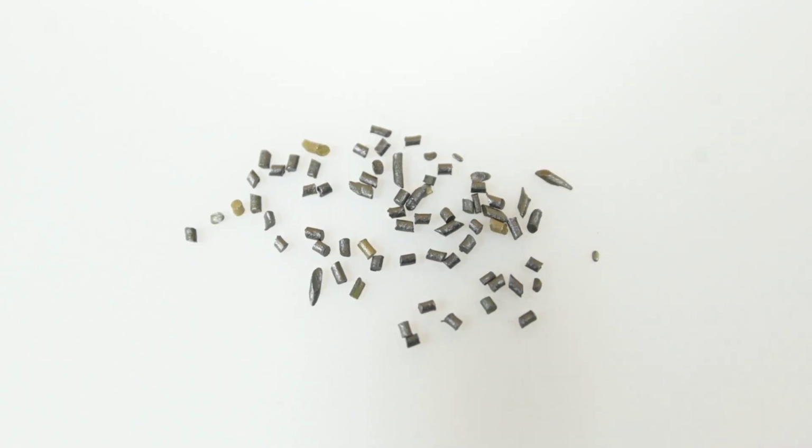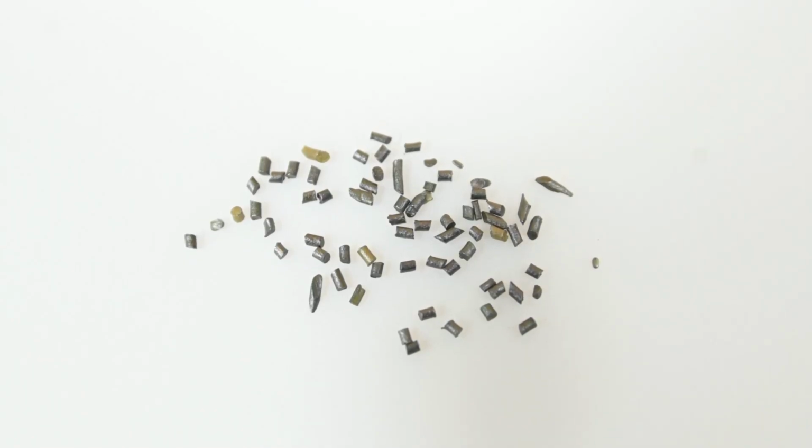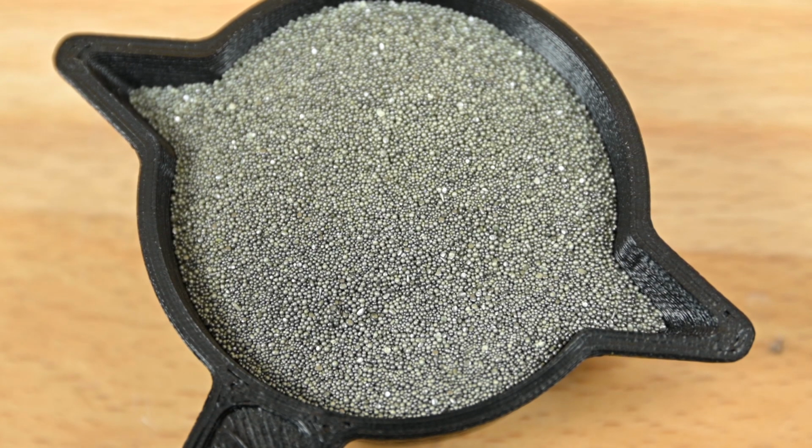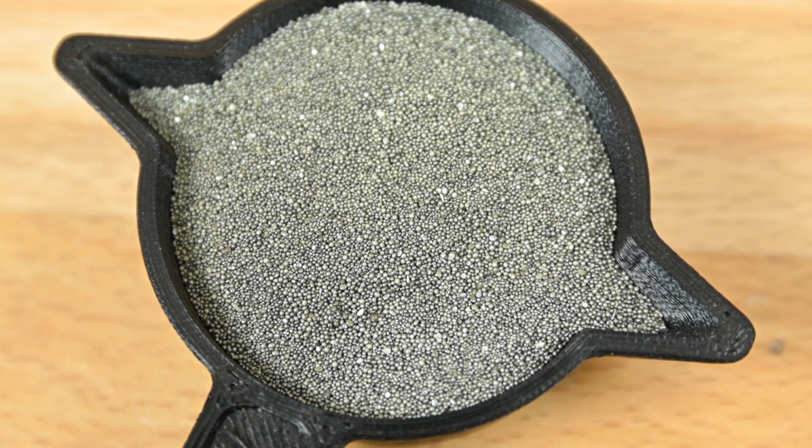propellant type and shape. For example, all of the extruded powders that look like little sticks have issues with all volumetric powder throwers. It's not an RCBS only issue, which is why you throw a charge weight under and then trickle up. For your ball powders and flake, the volumetric powder throwers actually work really well.